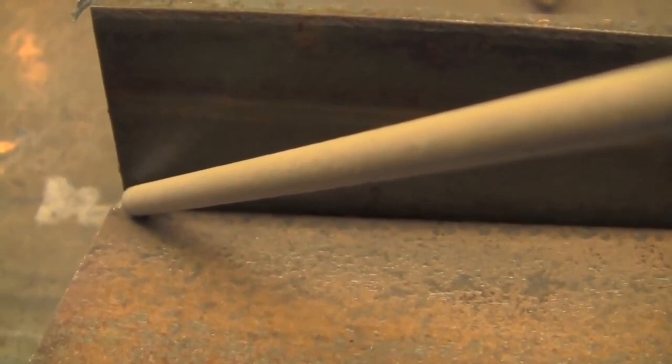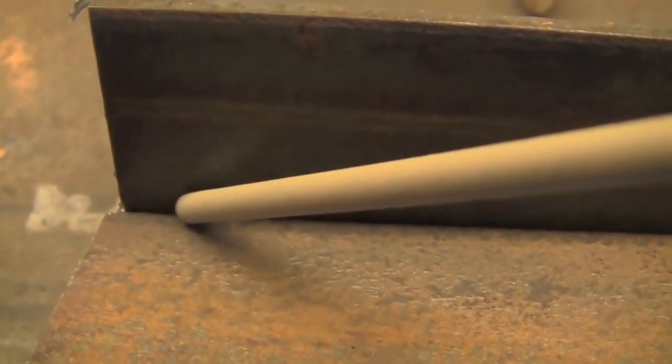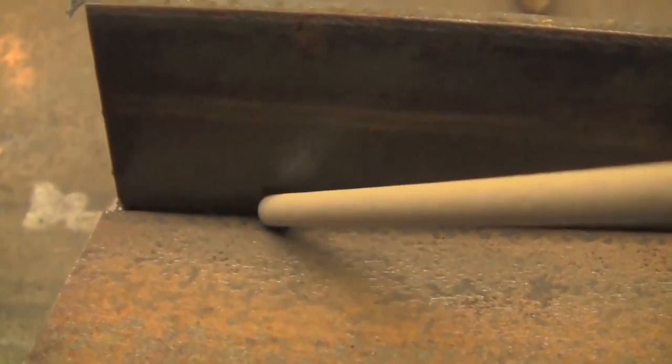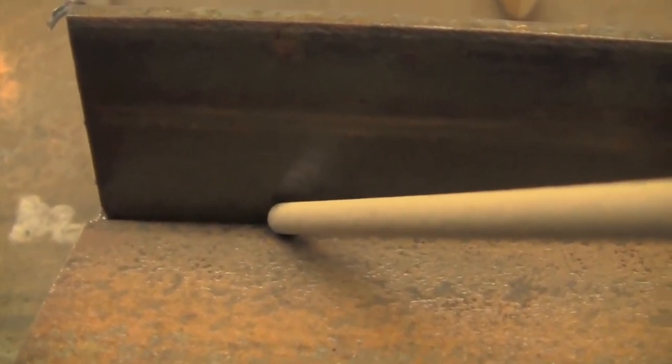Let's come over here and take a look at this joint. Now with most electrodes, you just start down at this end of the joint, weld your way straight across and call it good, but with 6010 and 6011 you have to put a little bit of motion in there. The first motion we're going to talk about and demonstrate is called the whip and pause. Basically, you start off forward a little ways, halfway back, forward a little ways, halfway back — and so on. Not all that complicated.